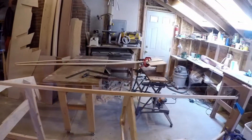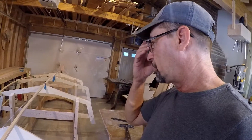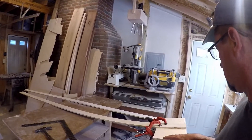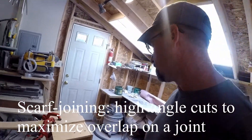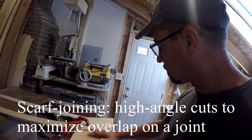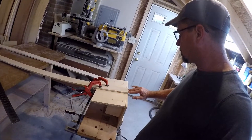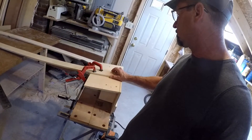We've got a few other things to do. We cut out the strips from the birch plywood — that'll be the keel. We've got two eight-foot strips that we ripped out with JT's help and we're going to need to join them. There's a concept called scarfing — I made a couple of scarfing jigs myself. We're going to cut a very shallow angle across one piece and another shallow angle across the other, get them so they lay on top of each other. Rather than a butt joint, which has no strength, a scarf joint has quite a bit more resilience.